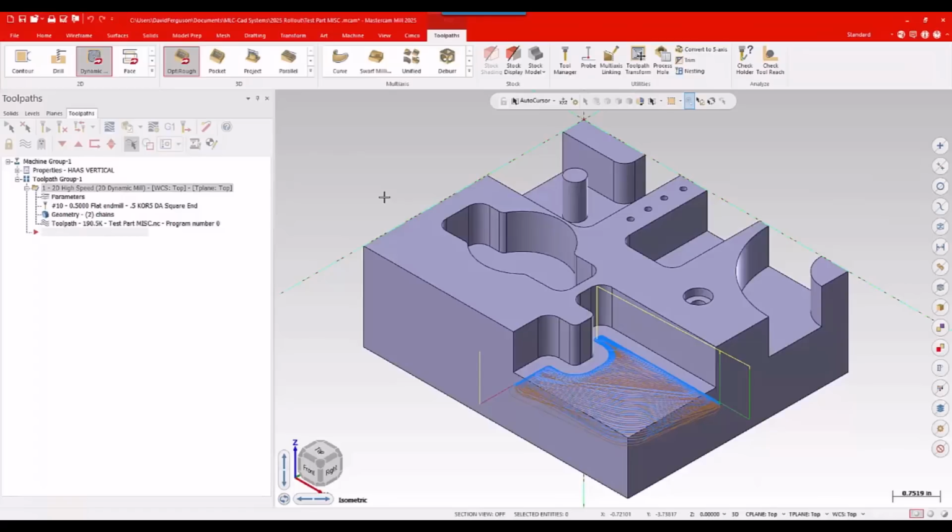Anyway, what I'm trying to demonstrate there is, once I've created a new tool, once I've tried it out, once I've got it where I like it, and I've tried it on a few different toolpaths, I'm saving those defaults, and I'm saving that tool, and I'm going to reuse those constantly. The more I do this, the more I build up that foundational database of tools with assemblies that are what I'm actually using, and actual settings for the toolpaths that I've dialed in and tested out. I'm ready to go. I'm not wasting or burning any time when it comes to actually using this stuff on a real part, because I've done all the grunt work on the early end, and that's really the idea with this. Okay? A little bit of busy work at the beginning just pays dividends down the road.